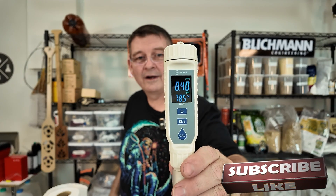If you do have a problem and you screw it up somewhere at 4, 6, or even at the 9.18, don't worry about it. Simply turn it off, rinse it in distilled water for a good minute, and start over. It's not that hard, and the first time is probably going to be the hardest because it's your first time. Don't forget to like, subscribe, keep sharing. Eric Hill pH meter — super easy to calibrate, great, reliable. I'm impressed so far.